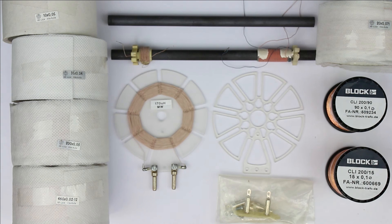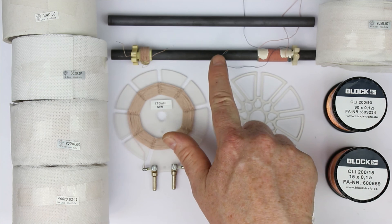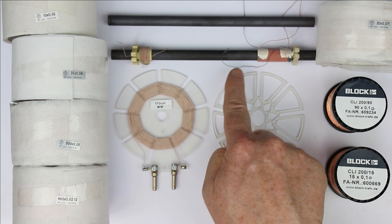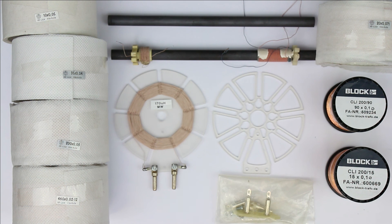If you liked it, give it a big thumbs up and subscribe to our channel if you want to be informed when we publish new parts of our detailed AM antenna construction video series — where I'll explain how to tin a Litz wire the right way, which is quite important because if even one strand of Litz wire is not tinned, the quality factor will go extremely down. And I'll show you how to wind your own spiderweb coil in a separate video.